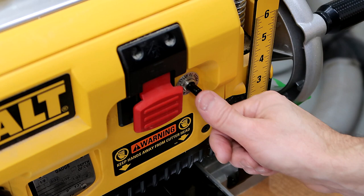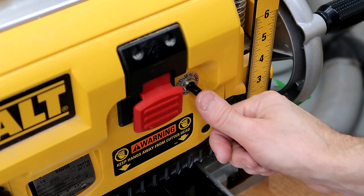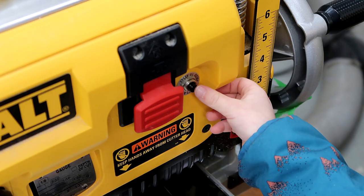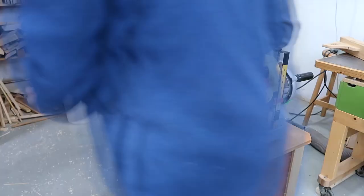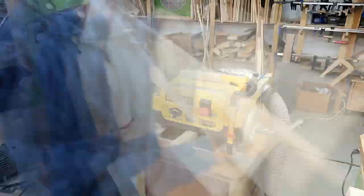Still not ready to set. Try pushing it — oh, there. I keep feeding in those same two pieces of scrap before and after each piece even though I've already planed them down. It doesn't matter as long as the infeed and outfeed rollers have something to rest on instead of just plunging down. That cuts down on the snipe.